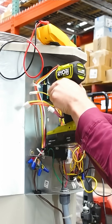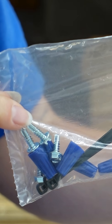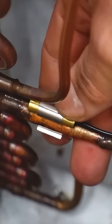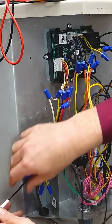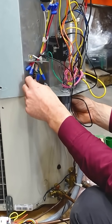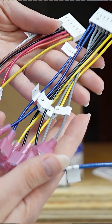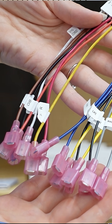It has quick and easy setup from mounting to programming. It can be mounted in any orientation with the self-tapping screws that come in the box. It comes with all the harnesses and sensors that you'll need. It includes a coil temp sensor that mounts right to the lowest point of the condenser coil, and an outdoor air temp sensor that can go just about anywhere so long as it's in the outdoor air. A lot of people strap it to the whip just outside the electrical box on the equipment — usually an easy and simple way to do it. The wires are labeled so they can easily be connected to the existing wiring with spade connectors or wire nuts.